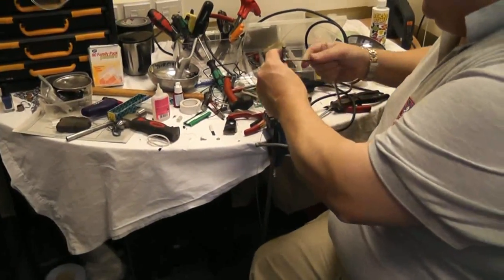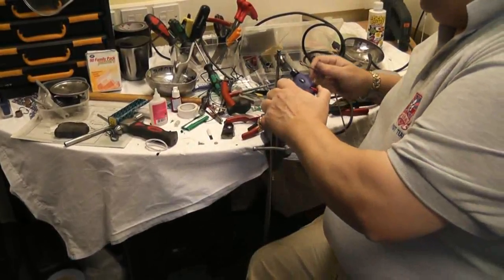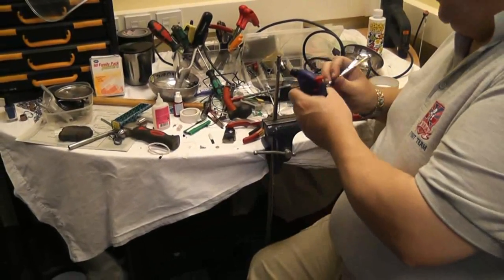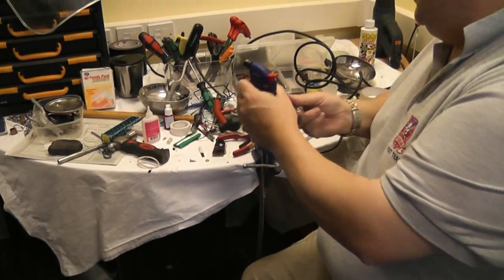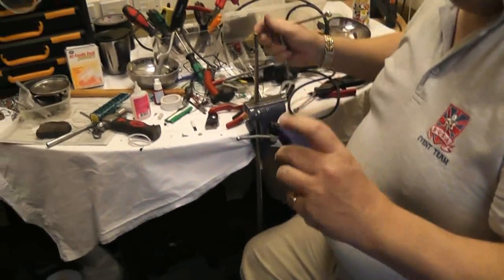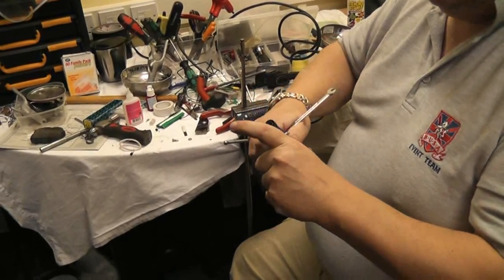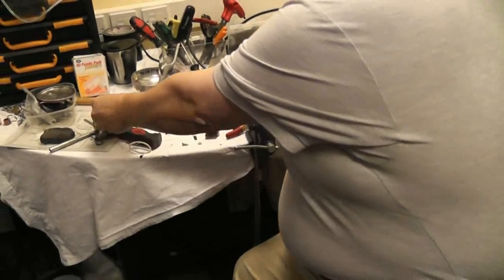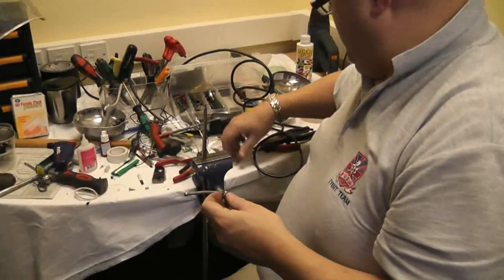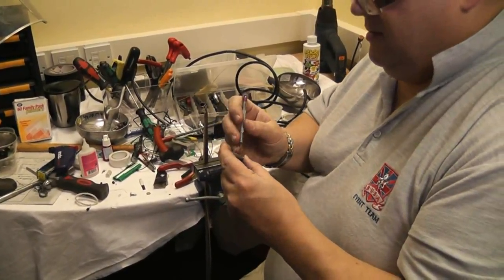This time it's a 6mm spanner. That's not wanting to come off - gentle application of a little heat. It's melted the glue that's formed around the barrel. Depending on how much heat you've put in, that gets rather hot. If you use too much heat you end up melting the plastic in the bottom, so be careful.